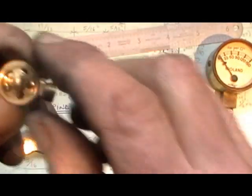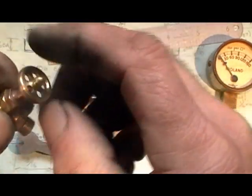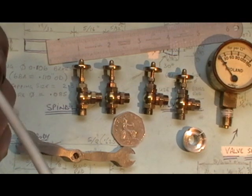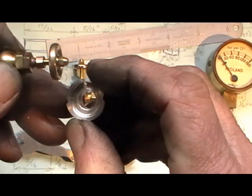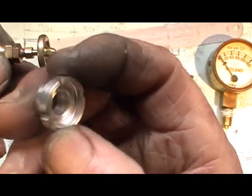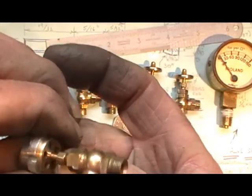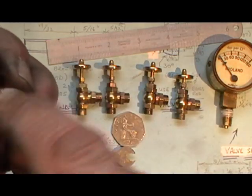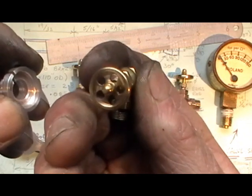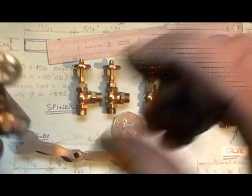For the knob, I made a batch — I drilled all the holes in a stock piece of material to the depth I needed, then put it back in the lathe and recessed the outside, then parted it off. Then I made a little split jig that fits in my three-jaw. When I've parted the knob off, I reverse it and put it in this jig, back into the lathe, and the split jig clamps the knob so I can recess the back to make it identical to the top. On top of the knob I made this 6BA domed locking nut to lock the knob on.